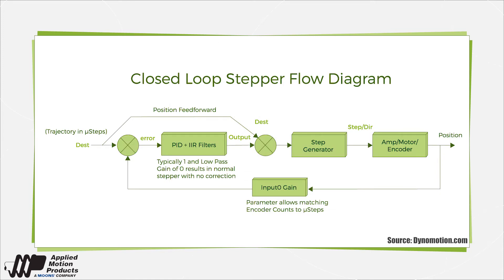In contrast, closed loop control designs use feedback data to correct for errors. The most basic closed loop feedback on stepper-based designs merely warns of missteps or stalls. In slightly more sophisticated setups, the drive microsteps the motor for step loss compensation. Controls generate direction and current pulse commands to make the motor track target moves.